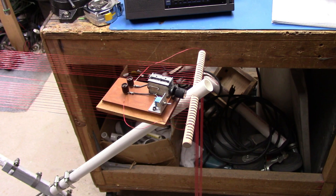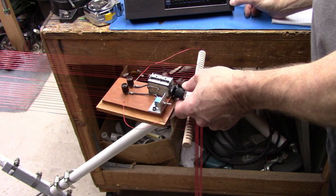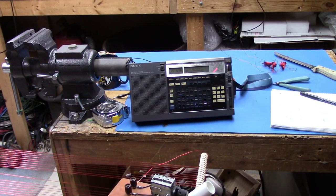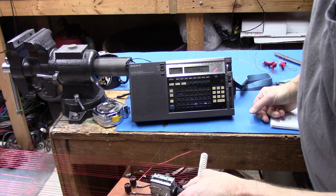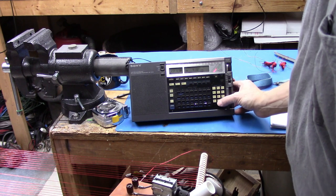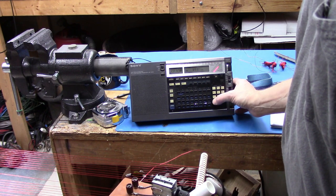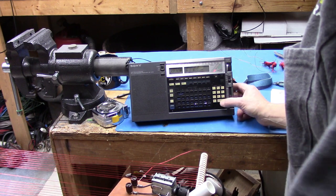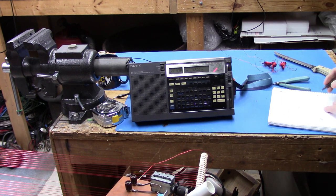All right, so we're at 18 turns now, and we're gonna go up to the top end of the band. We're gonna start at 900 kilohertz. Okay, noisy as it might be, it resonates at 900 now. When we last left our Cape Crusaders, it was 830. Okay, so 910 maybe. Wow, huge signal there. Okay, let's see, 940. Nope, 920. Okay, 920 is the high end from 830, so 920, writing this down with 18 turns.